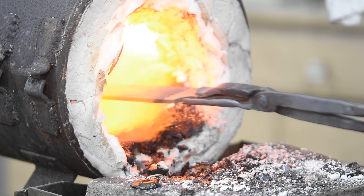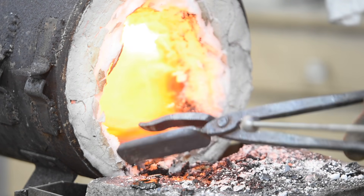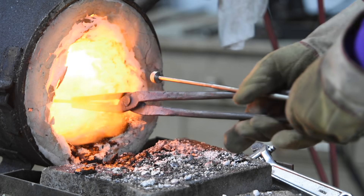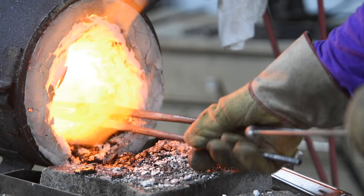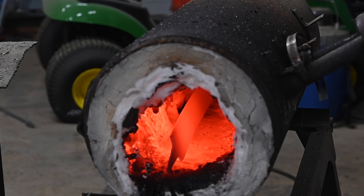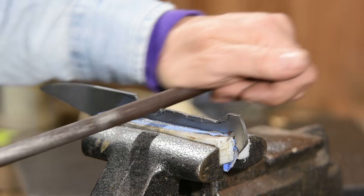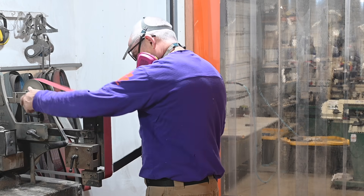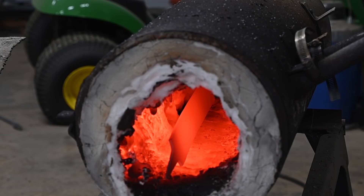The first step of this build will be to anneal the blade. Annealing is basically just heating the blade up to a red heat, then letting it cool as slowly as possible. There's a lot more metallurgical complexity to annealing if you want to dig into it, but just trust me — if you heat a file up until it gets non-magnetic and then leave it in your forge, it'll get very soft. If you want to make a knife from a file using just a metal file to shape it, you definitely want to anneal. If you're using a grinder like I'll be doing, annealing will still make the task easier and quicker because the steel will be softer.